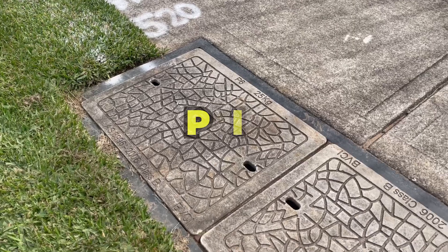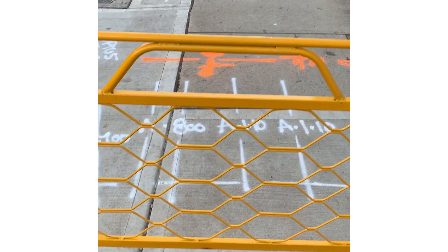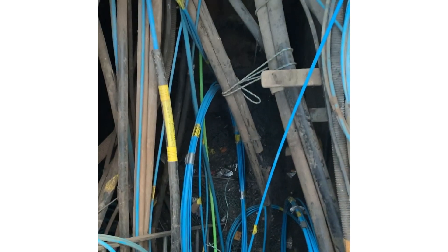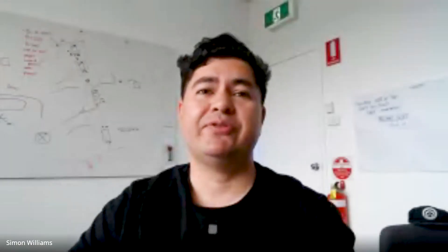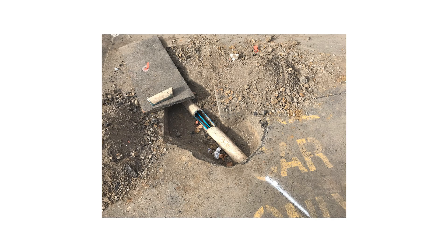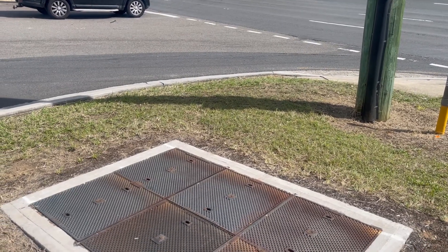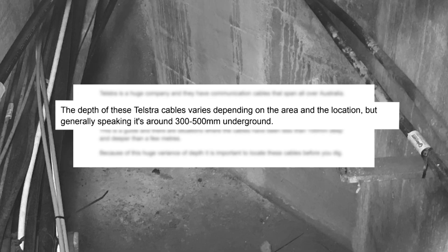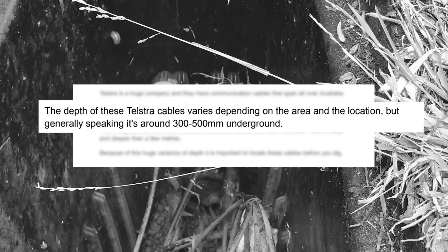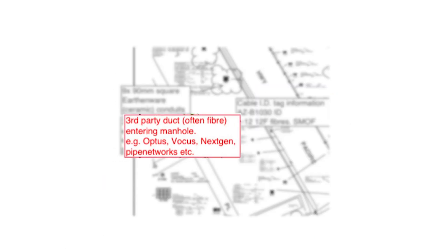What's on the plans? The Telstra network consists of pits, cables, conduits, manholes, footwell chambers, footpath chambers, and anything associated with Telstra cables entering properties. There are lines indicating where the cables run, information on the conduit configuration and the cables inside those conduits, the amount of cables inside a certain duct, and how many twisted pairs are inside. The plans show the distance between two manholes and cable information. On the mains cable plans, they'll show you depths and offsets, displayed as a fraction with the cover over the offset measurement. There are also termination points where the cable network enters a property, plus third-party cables, fiber optic breakout pits, and other networks utilizing the Telstra network.